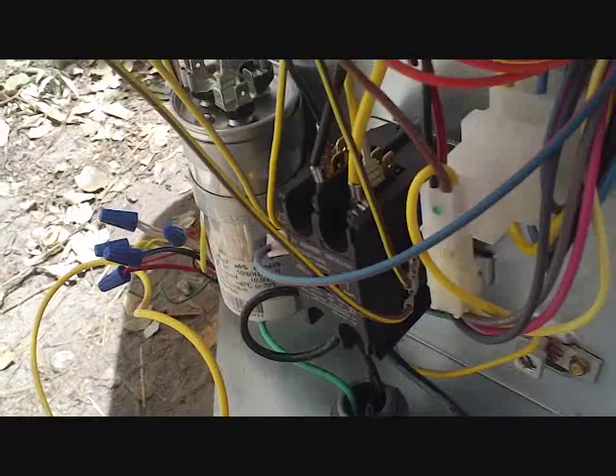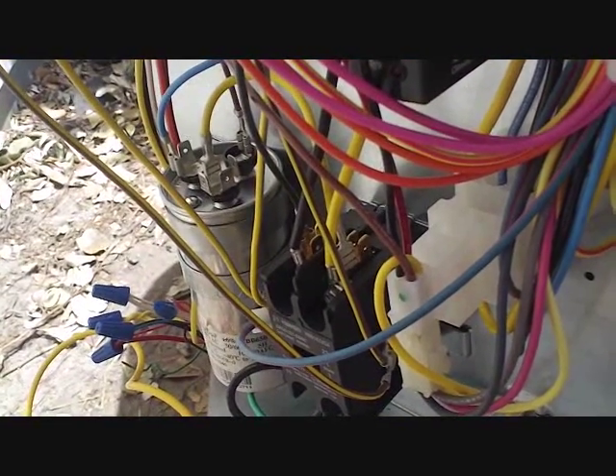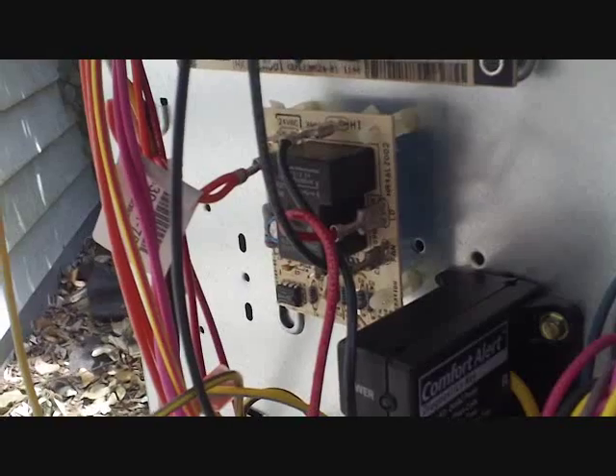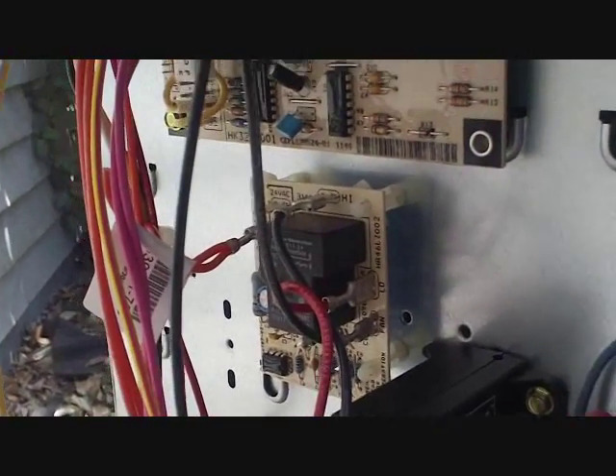This line set is new, so I have concerns. I'm going to have to do a little experimentation, probably back at the shop at my house, to figure out what's going on. The first time I did this it was plowing through it, but my vacuum pump oil wasn't changed between this time and last time, which is a factor. I'm still a little surprised by it though.